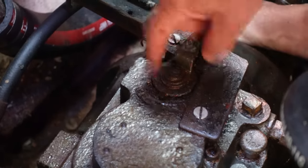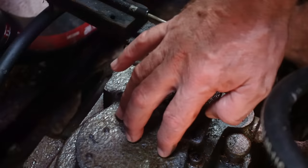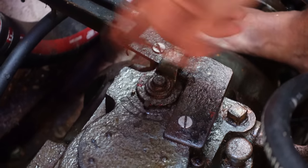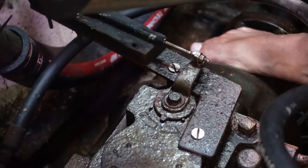This is the gear selector — forward, reverse — and underneath is a piston with an O-ring that rests against this housing. Either this housing is rusted and wrecked the O-ring, or the O-ring has perished. This is like a 50-year-old gearbox; they don't even make them anymore and parts are very limited. I think in the US there are a couple of suppliers where you can get used and some new parts, but they're pretty old. They're a tough gearbox but like anything mechanical they have a life.